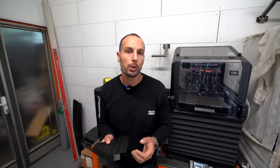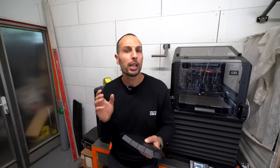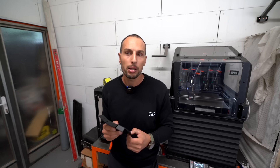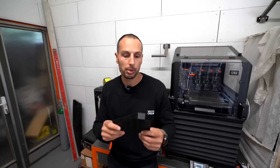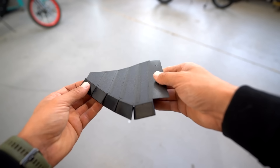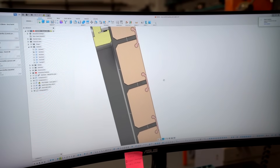We've been using the Prusa XL for some time and it's amazing — the new feature with multiple heads that just picks up a different head with different filament and continues printing without user intervention. At the beginning I thought about how we could use this, because we don't really make statues or toys that require multiple different colors. Instead, it made me think about how we can combine different properties of different filaments. For example, this 3D printed door is such a killer design because it combines the stiff, hard properties of PETG filament together with flex — we 3D model locks for the flexible filament to hold in the PETG.